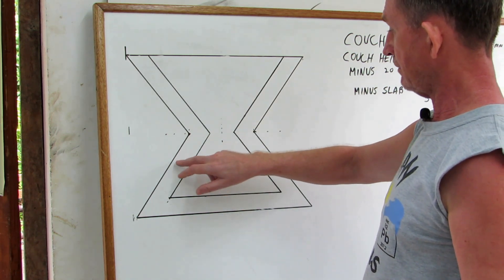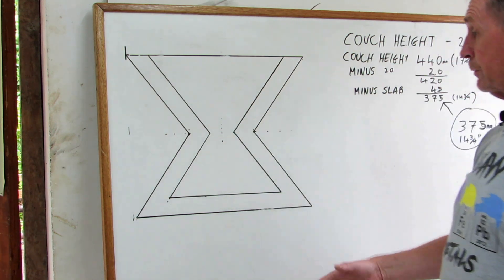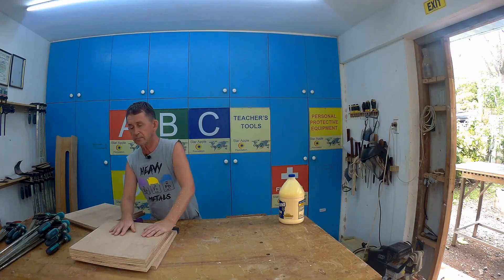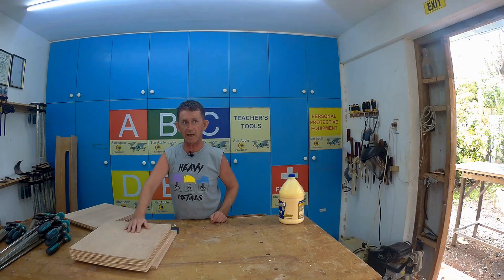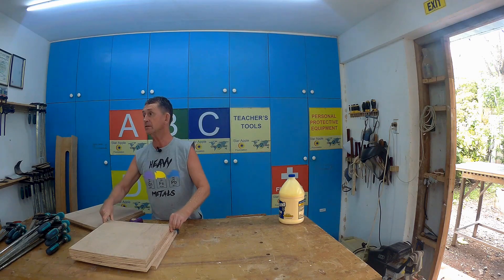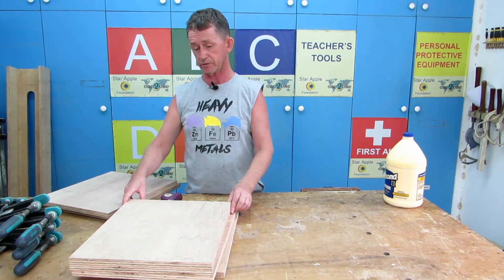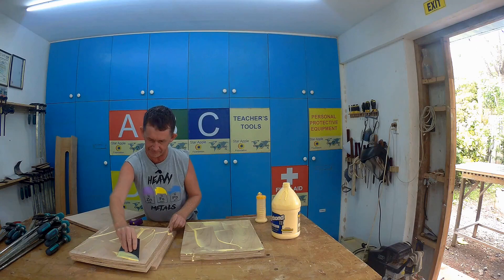I joined them all up and measured 40mm - you can see my dots, the dotted line is the center. I'm going to put this onto the plywood and make up the legs. I cut the plywood and I'm going to glue them before I cut them. I was going to cut three pieces for each side then glue after making the shape, but I'm going to do it on the bandsaw. If you were doing it with a jigsaw, probably better off cutting them separately.